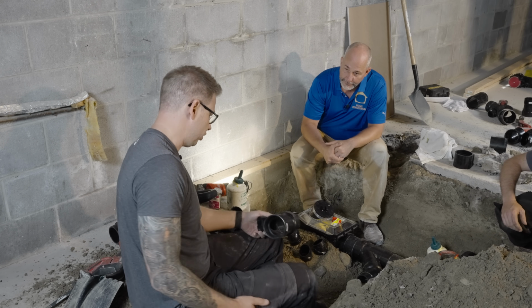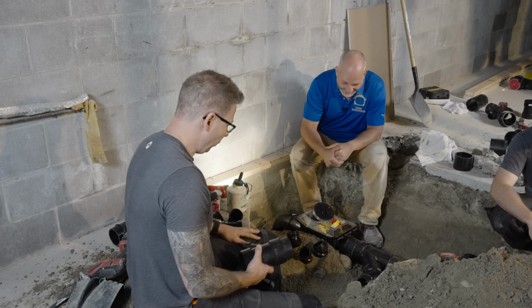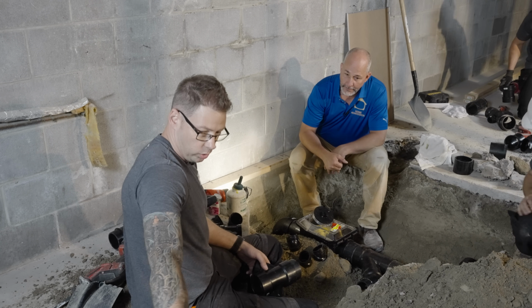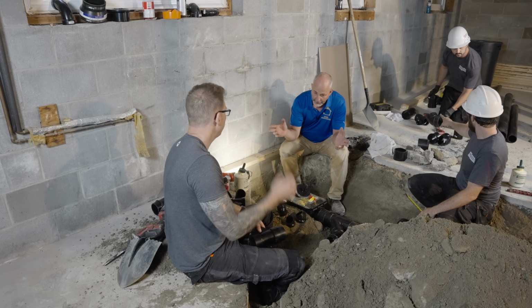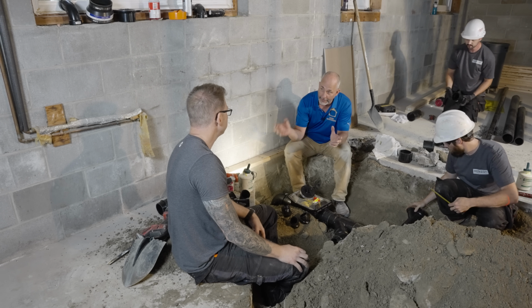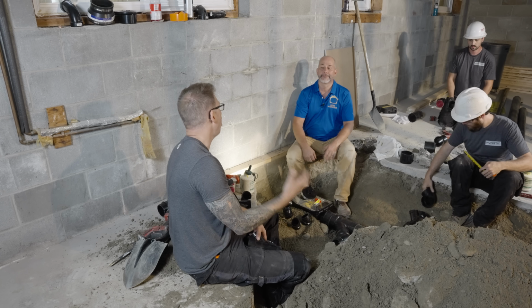So we're actually separating the two so that they independently drain into the 3-inch line, which is also picking up the floor drain and the condensate. The idea here is to avoid having those two mix on a 2-inch. On the 2-inch line, that's right. Because we can still have a combination of soaps and hair and other things that can get almost cementitious in there. This is a long-term problem.